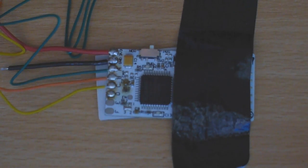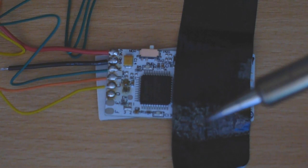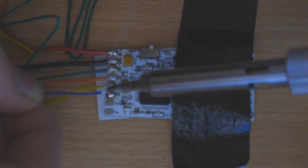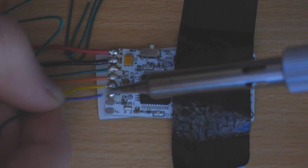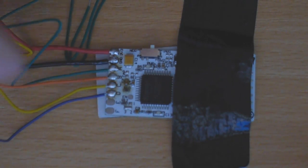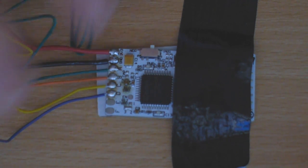So I've got 2 blue wires. I'm not sure which ones are going to be long enough, so I may have to change out the wires. But okay, so for D, the CPU reset, you can just use a normal wire from the slim cable. The blue one from the slim cable will do for that, if you don't have the double shielded one. In fact, you don't need the double shielded one at all, but it's recommended to have it. But then for RGH1.2 I don't see how you would really use it unless you can still use the old reset point, which you might be able to still use. Other than that, just use a normal wire, and that's us got everything prepped.